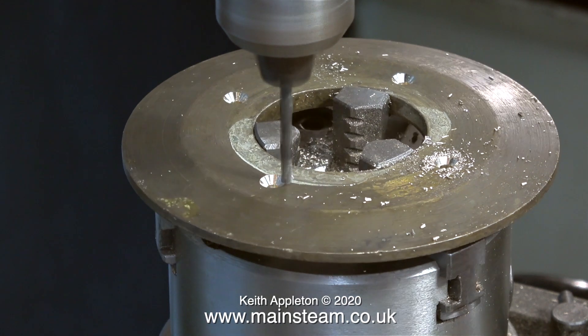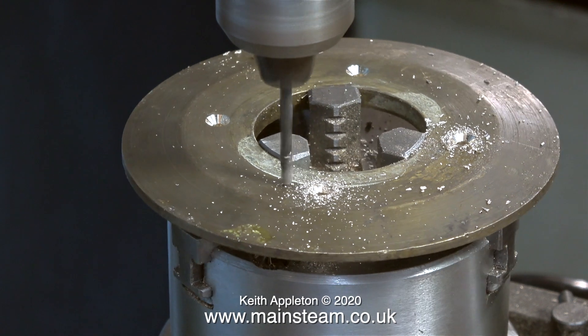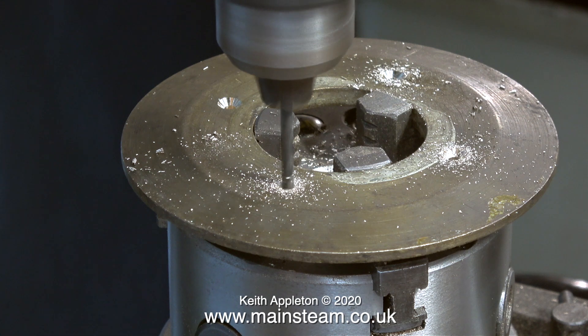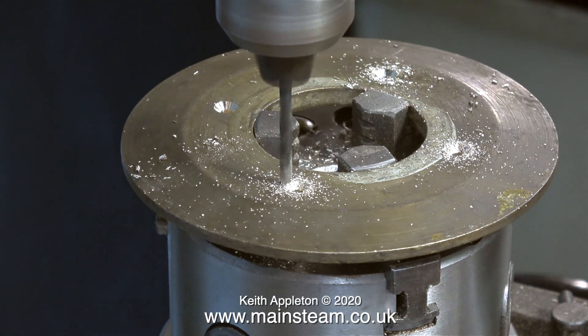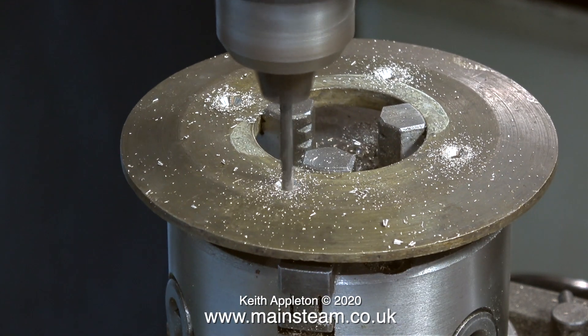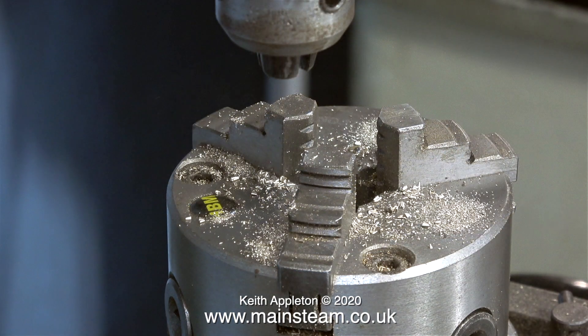All you're doing is rotating the table at 90-degree intervals — because four 90s equals 360, it's quite straightforward, particularly if the number of holes divides into 360. It only gets complicated with things like gear cutting or anything that doesn't divide well into 360. For more complexity you use dividing plates; some came with this rotary table, but I've never had any need to cut gears. Rotary tables used to be fantastically expensive but now they're really cheap — the quality may not be as good as the old days, but they do the job and are especially time-saving for simple jobs like this.